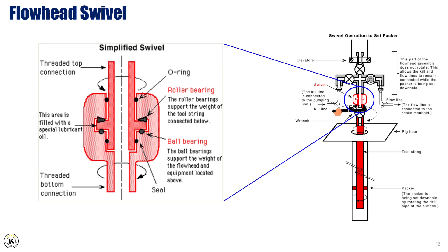Ball bearings are used to support the lighter weight of the flowhead and the equipment above the flowhead. The swivel should not be rotated under pressure, meaning it is not designed to hold pressure when subjected to continuous rotating movement as in drilling operations. The most common applications are done with pressure close or equal to zero at a very low rotating speed. During a well test, the pressure can be close to the swivel working pressure, but the swivel either does not move onshore or oscillates a little due to heave offshore.